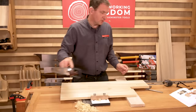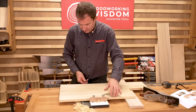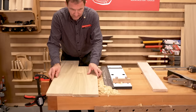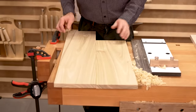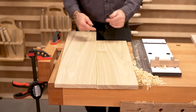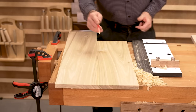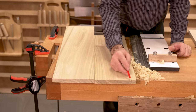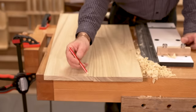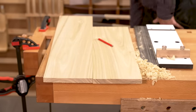Hopefully, I think you've mastered and watched all of that. A bit of fun trying to turn the boards round. If I move these round to here, I think you can probably see up the board how the grain colour, I'm looking at the coloration coming up, trying to match that. This is on the top, it's the most prominent bit you're going to see. On the end grain section, I've got one that goes cupping will go down, so annual rings, the other one reverses, so they're opposite, okay? So that's quite an important part.